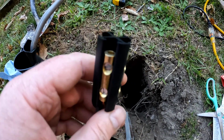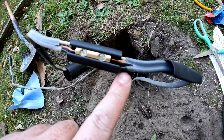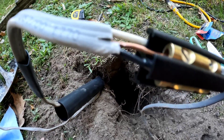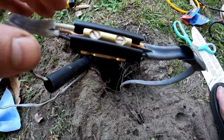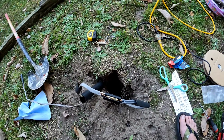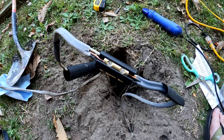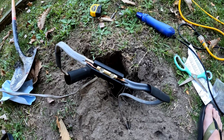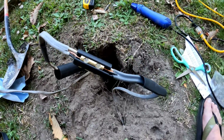I'm done applying the splice. I learned my lesson from the first side and stripped a bit more insulation off — it was easier to feed in. I've got black to black, ground across the top, and white to white. Double-checked all screws are tight. Before heat shrinking, I flipped the breaker back on to make sure everything looks good. The breaker didn't trip. I went to my shed, turned on the light, my table saw, and a die grinder — things that pull a lot of current — and everything looks good. I flipped the breaker back off and verified it's dead again.